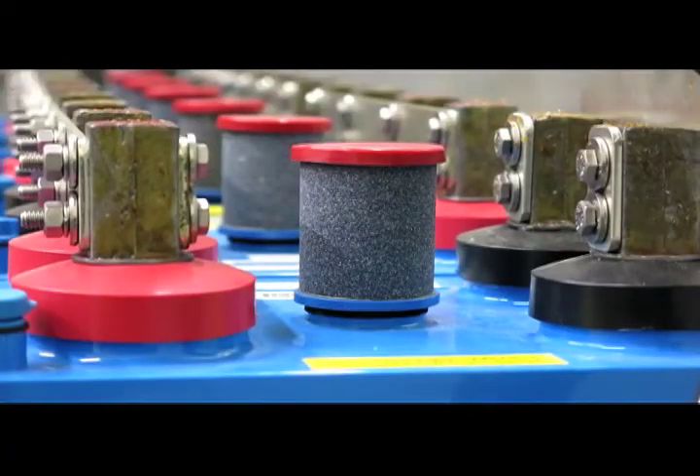These are the flame arrestors in the cell. The job of the flame arrestor is to prevent an external spark or flame from causing an internal explosion within the cell. The gases exiting the cell are 67% hydrogen and 33% oxygen, and are diffused through the fused aluminum stone such that if they are ignited by an arc or flame outside the cell and get sucked back in, the fused aluminum stone will cool that flame to below the ignition temperature of the gases within the cell.